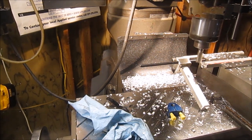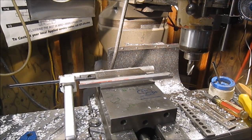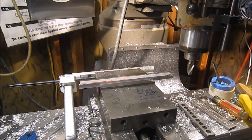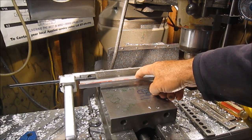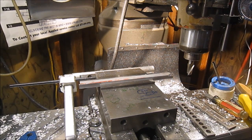Frame? Yeah, almost in frame. Now, let me do some checking and measuring. So since it's a 3/4 inch cutter, just with the DRO moved over 3/4 inches to get to the other side of the cutter, and then the 368 I needed, and gave myself a little so I can come back and clean.